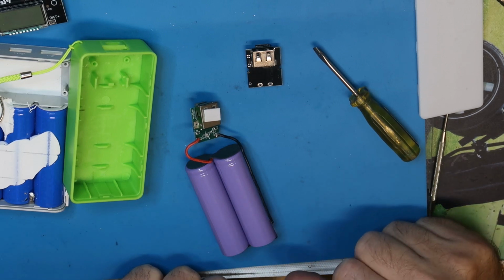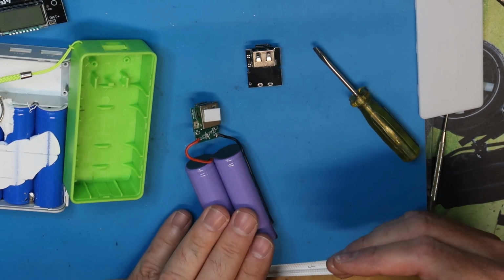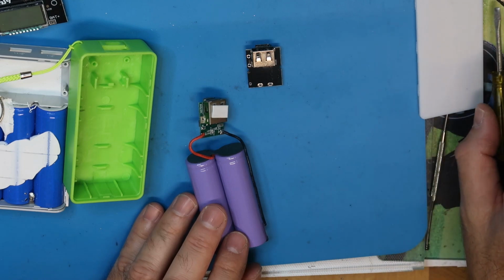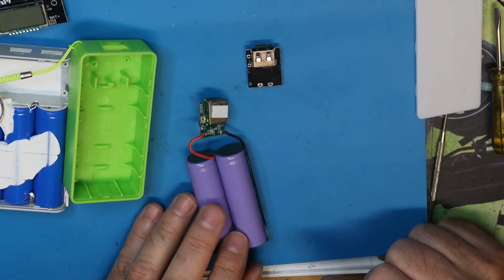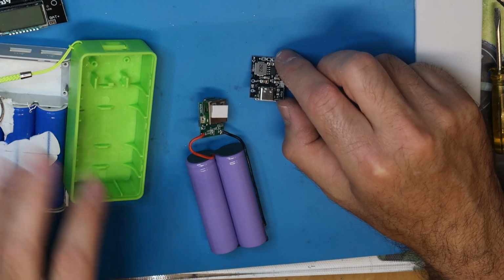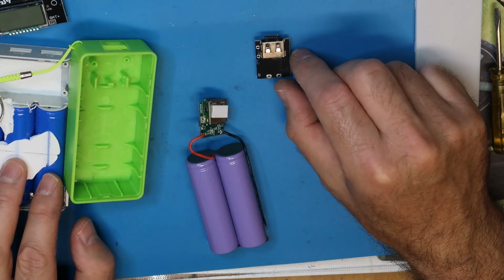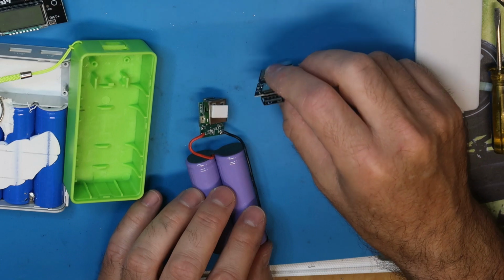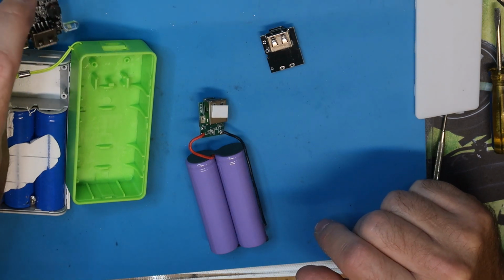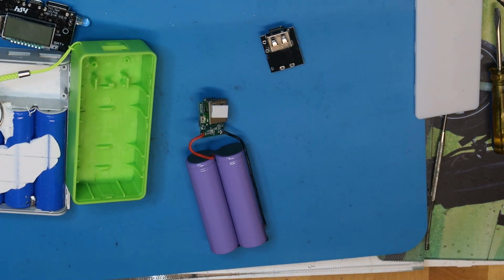Of course it is a good thing to try again to use it. Many chargers today have the ability to see how much capacity is inside while charging, and in some of the chargers you can also discharge and make sure that the capacity of the cells is okay. And also you want to make sure that the power bank you're using is not overloading your cells. So in this case I'm using about a 2 amp charger and 2 amp discharge. No need for more than this, and of course these cells can handle it. And not to use a board that is not suitable for your cells, so you have to know a few things before doing it. So I will connect it, and then we'll see how it looks.